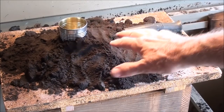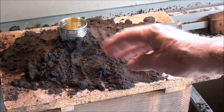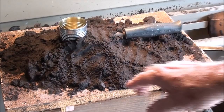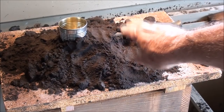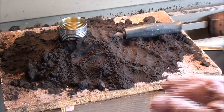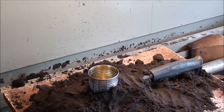I think I got the sand all packed and leveled and the handle level, so it won't leak and won't move. This pot that I'm using is most awkward. There's no pouring lip on it, and it's not really made to pour out of, but I don't want to bump this when I do that, and I don't want to fill it quite to the brim, because I located the hole just slightly below, so there'd be some to trim off, because the top of it is probably going to be irregular and full of dross, or a little bit of dross or something. Unsightly. Not that it would matter, but possibly unsightly. So I'm all ready to pour, I think, and the metal's about ready to go. I'm ready to pour.